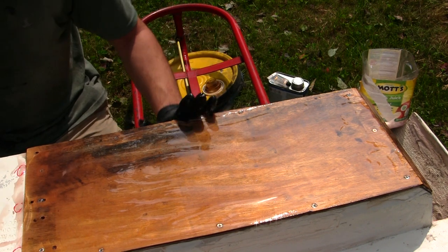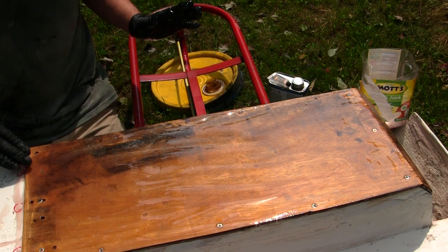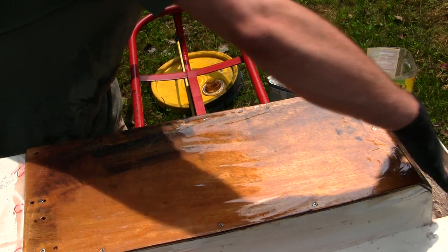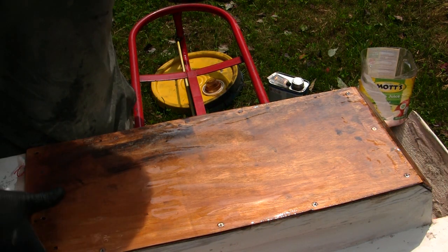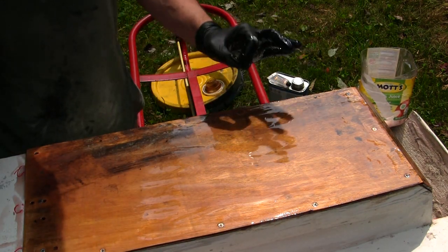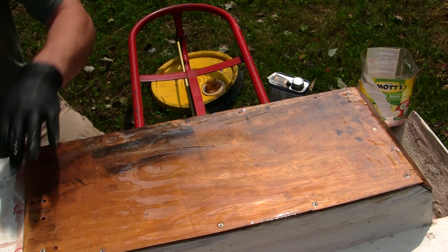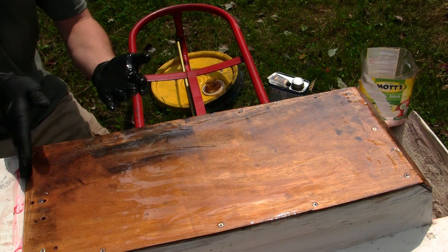Also, another thing I want to mention at this time is that the countersinks are as flush as possible. Or actually, they're below the surface as possible, as I always mention in these videos. That is done strategically because it's easier to sand away bodywork material than it is to sand away a metal fastener. And when the thing is absolutely flush, you will have difficulty getting rid of that little indication point where the two items are located. And that's something I do on my Armortech builds, and that's something that's true for basically every one of my builds. I always like doing that for good measure.